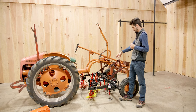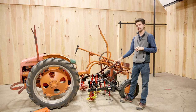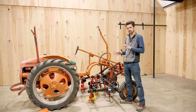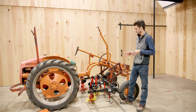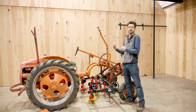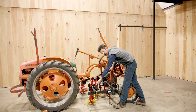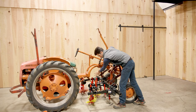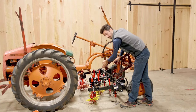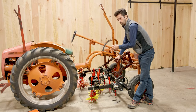We tend to recommend adding something in front, so for this setup we went with A-blades — I've got an A-blade here and an A-blade here, with rows coming through this area. If I had something like a vegetable knife, tender plant hoe, or disc, I'd need one on each side plus another one next to the middle row, and that creates very limited space on the toolbar for hooking up the different accessories. I'm going to touch on the 9-inch setup here — how it does work, potential challenges and cautions — and then we'll go to the 13-inch.